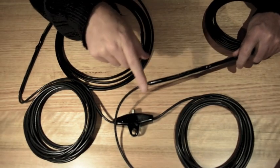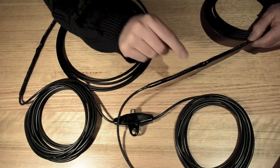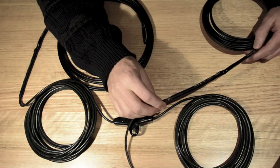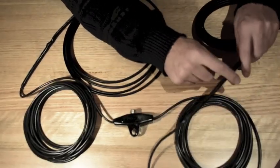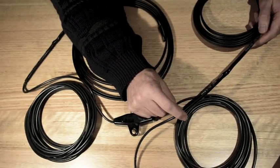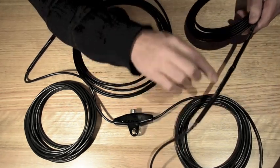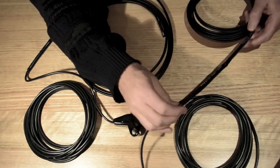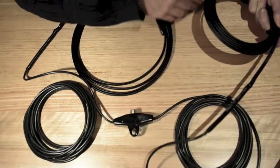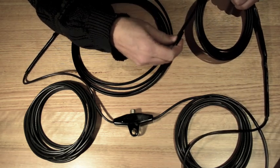The point between the coax and the twin lead can sometimes be a problem for home constructors of the Double Bazooka or some commercially available antennas — it's at this junction that the antenna will often break away. However, this Double Bazooka feels very solid. You can feel through the plastic where the join is. The whole area is covered with quite a thick plastic sheath, and where the sheath ends there is quite some distance on both sides, which supports the connection. There's also very good sealant to keep out moisture, and a moulded plastic end on the twin lead to keep the antenna nice and dry.